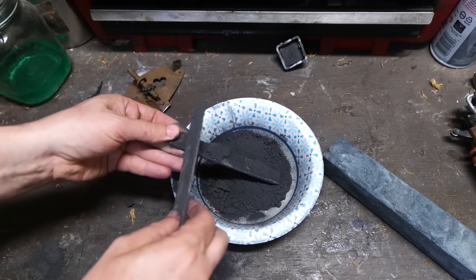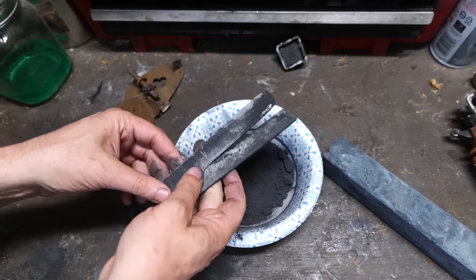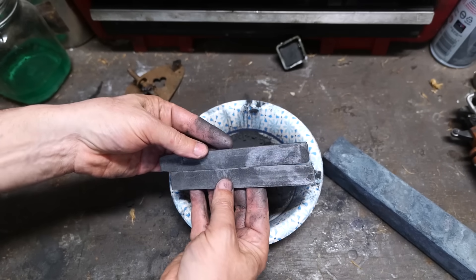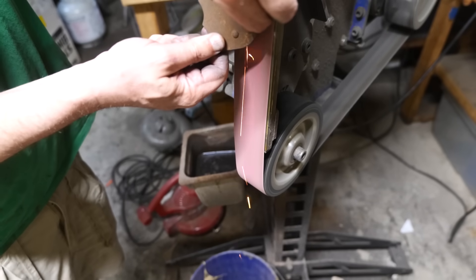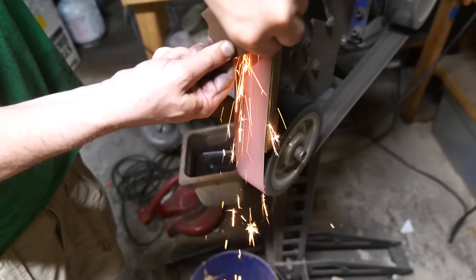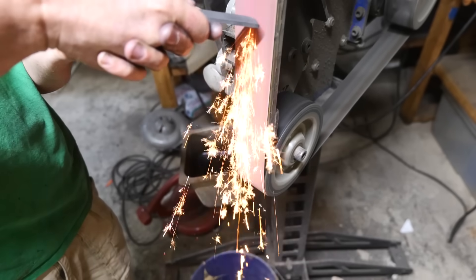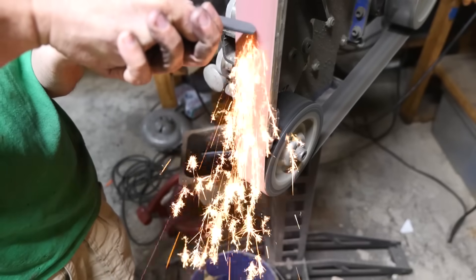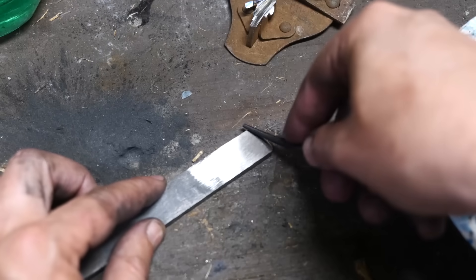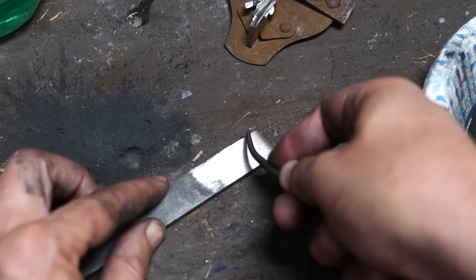I don't see any blisters or defects or overcooking like I've seen in the past with some projects. So let's take this and spark test it and see how much carbon there is. First up is a bit of our original ice skate blade — sparse, long, non-bursty stuff like mild steel. Here's our carburized steel, and that's a lot of short bursty sparks. We like to see that in high carbon steel, but I'm already wondering if we've overdone it a bit. After a water quench, the hardness is over 65 HRC — very hard.